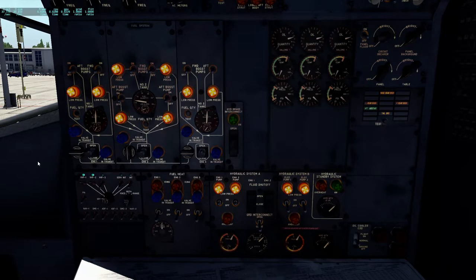Now because we're only using so much fuel, we have the same amount of fuel in each tank. The APU uses the center tank, so I have about 100 pounds extra fuel in the center tank. But what is needed is, since all fuel tanks are equal and each engine uses its own fuel tank, engine 1 uses the left tank, engine 3 uses the right tank, and engine 2 uses the center tank. That means if all tanks are equal in quantities, your valve should be closed on tank 1 and 3 and open on tank 2. That's the configuration for the fuel system, as checked.